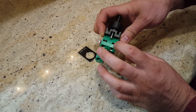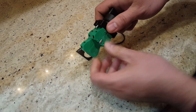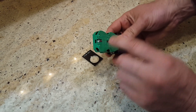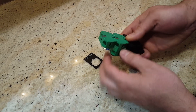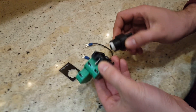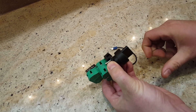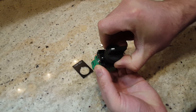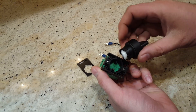The black part is the switch body from Automation Direct, and the contacts are sold separately, also from Automation Direct. The green ones are normally open — meaning they're open until you flip the switch, and then the contact closes. These contact modules stack on top of each other: there's a little screw and you just slide one module onto the one below. You can stack as many as you need, limited only by the depth of your enclosure box.